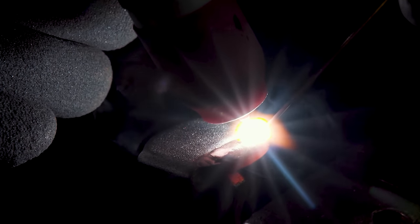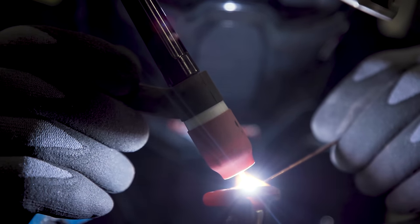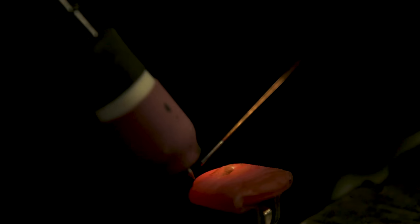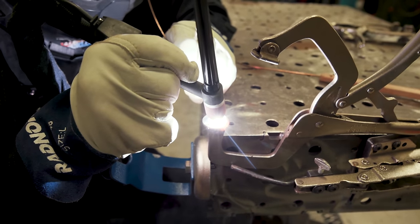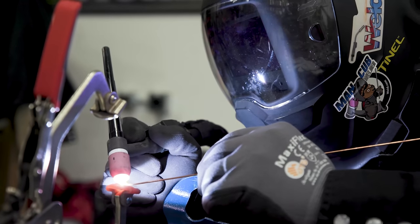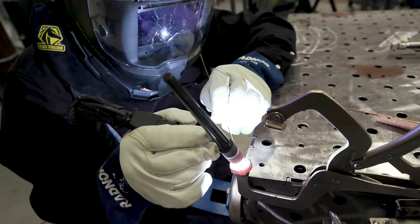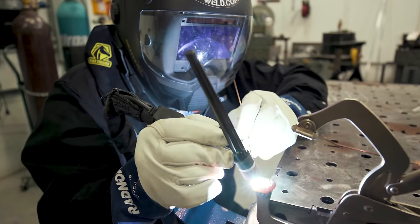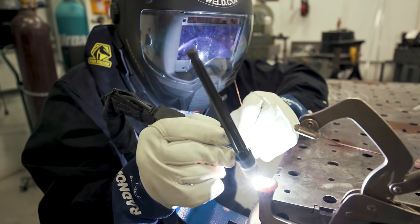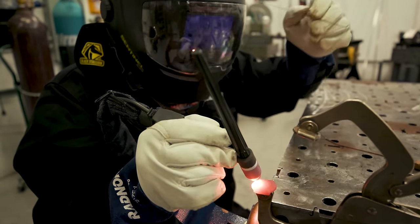If you have low spots, we can go back through later and fill those in. You can do this on your regular finger clamps too — it doesn't just have to be the ones with swivel pads. If they have points on them, you can do that as well. A lot of people use this on their third hands — just put a little bit on the point for better conductivity with electricity. I'm on regular DC negative at about 65 amps, not really using all of it — just need to get the silicon bronze into a liquid state to flow over that foot. I'll build it up a bit higher than needed since I'll be grinding it down once we're done, and I'll do both the top and bottom foot.